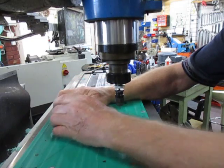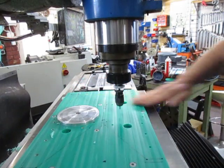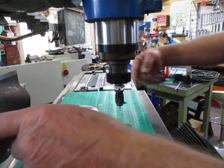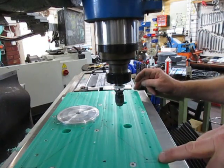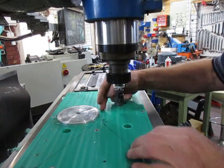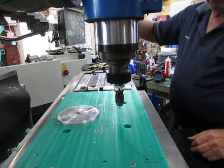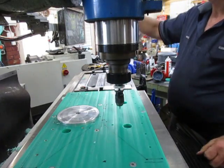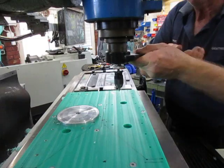The correct diameter needs to be 110 millimeters. This is the unit I used to set up when I originally took the photos, so that fits in there neatly — that's what we want, an exact fit. Now I've drilled all these holes on this side. I flipped the plate around so it was easier for reading rather than trying to work backwards, and I've counter-bored and drilled all these. Now I need to tap and insert them, and I've marked out the outside periphery using this little chuck for centering.